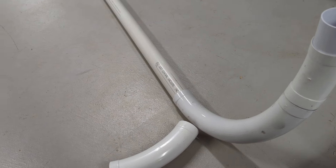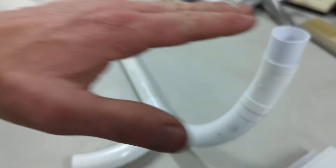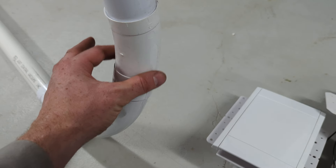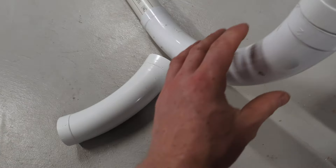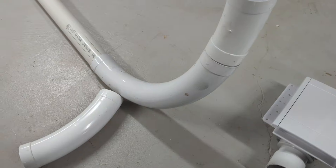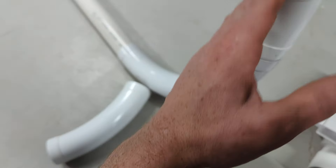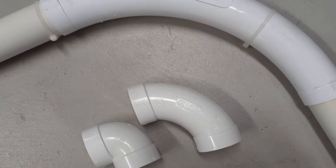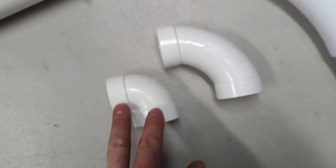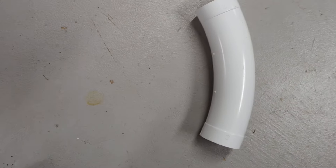In Chicagoland, a lot of basements are finished right off the bat with soffits around the piping, meaning pipe can run in the joist and then dip below using a 22.5-degree elbow — that's to be avoided, but when you can't avoid it, you can't. These retractable fittings are really big — they remind you of the pneumatic tube fittings at a bank. The hose is traveling through, and you have 90s, 45s, and 22s. If you compare a retractable 90 to a standard central vac 90 or a short-radius 90, you can see what a difference there is — there needs to be room for these.